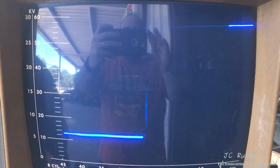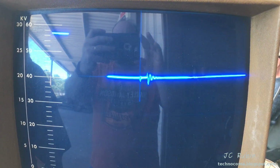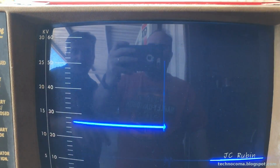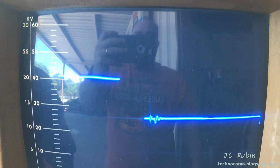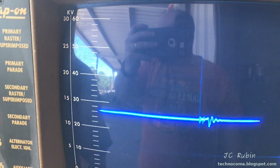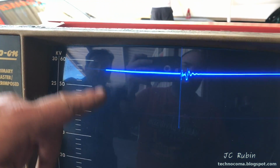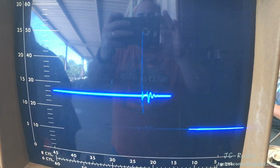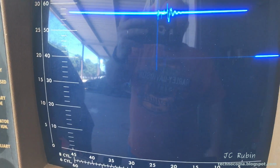And he's going to pull the plug wire right now on number 2. And we see up here an anomaly. The spark plug, the spark is gone. And we can see that anomaly is being displayed right now. Interesting that number 2 showing up on the top one. You notice that? 1432 is the firing order, of course. Yeah, correct. Try that again by pulling another wire. Yeah, pull 3. No, down here. Maybe a 1342. Plugs are 1432. Okay.